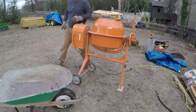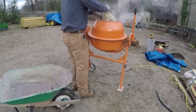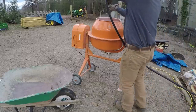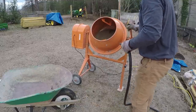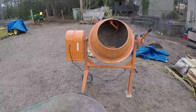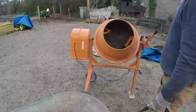A quick note on safety: you should wear a face mask when doing this. As you can see here, I'm making an attempt to stay upwind of any dust, but depending on the wind conditions that can be very difficult, especially indoors. You should also wear gloves when working with concrete — concrete is a very basic material and will dry out your skin quickly. One tip: after working with concrete, rinse your hands with white vinegar to neutralize the base and get your skin back to normal.